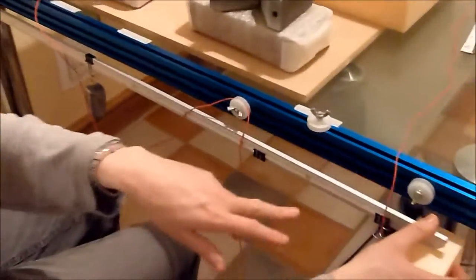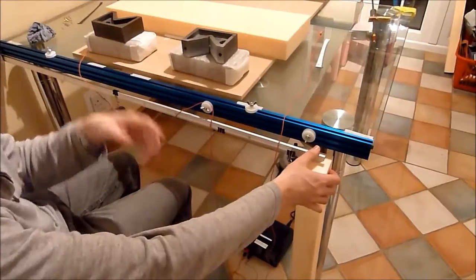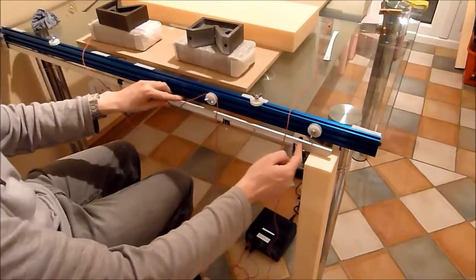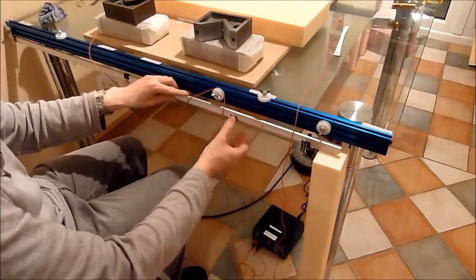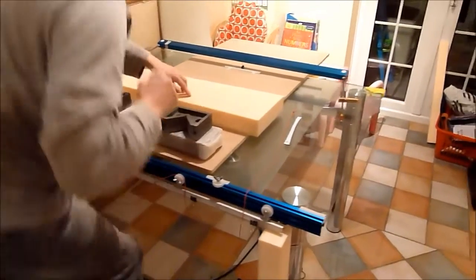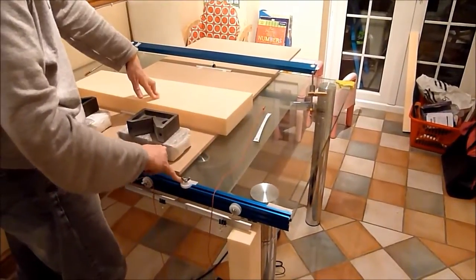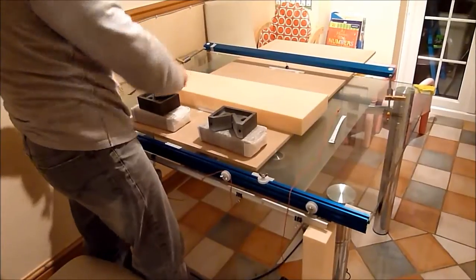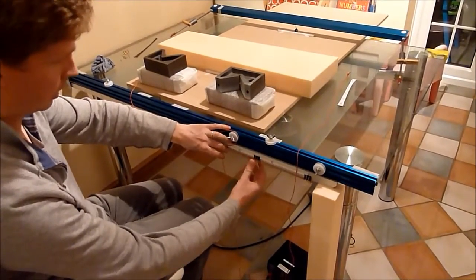Then we've got these 2 clips. This is important. So you'll see there are numbers on here, 60, 70, 80, 90, 100 under there. This is where you get the differential in the pull. So the long end, the root end of any core will always be attached to this end of the bow, the 100% point. This distance, this percentage, is calculated by the ratio of the root to tip. So in fact it's not quite the root to tip, and you read the instructions, it's actually the distance from the front of the wire, the length of the pull cord from here to the middle of that pulley. So if that was 100mm and the same distance on this side was 80mm, that would mean we'd be attaching this clip at 80, like that. Simple as that.